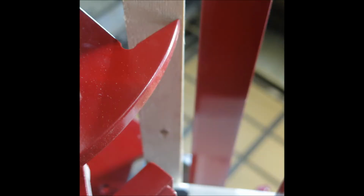The rack should be adjusted so that when the stake is all the way down on the rack, the pickup wheel will come around and hit the top 1/8 inch of the stake. This will allow the stake to rotate a quarter turn into the clamp.